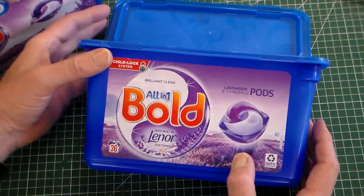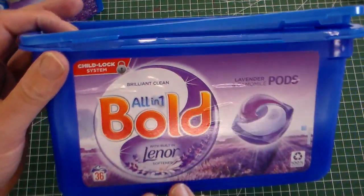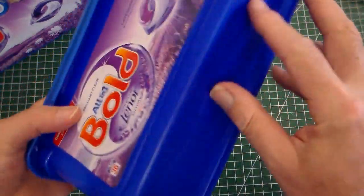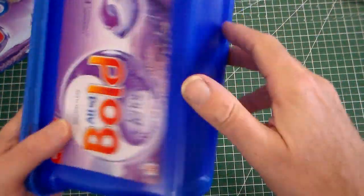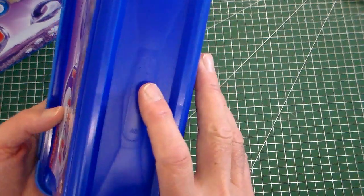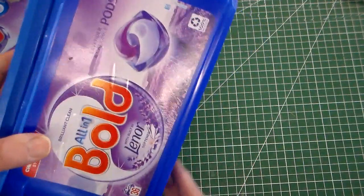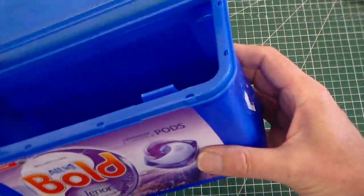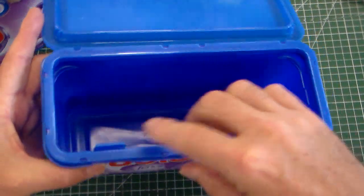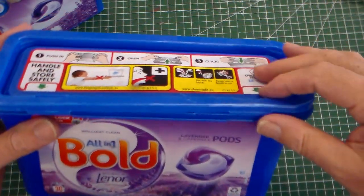This first solution is a polymer box. It has a child lock system. The lower part is vacuum formed — you can see there are no eject pin marks. It's made from polypropylene — you can see the number five and the PP mark. The top is a second component clipped on, with a lock mechanism, and this part is injection moulded.